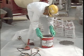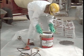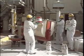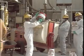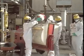The convenient packaging of Chockfast Red is such that the hardener is contained in a plastic tray which is inside the resin container. The unique formulation of the Chockfast Red aggregate is a low-dust material which saves time during cleanup and does not expose workers to excessive amounts of airborne dust particles typical with most epoxy grouts.